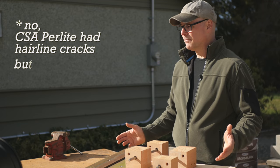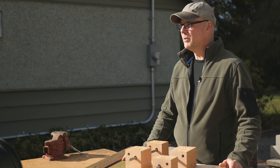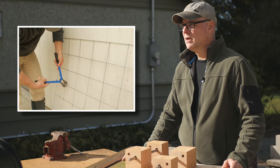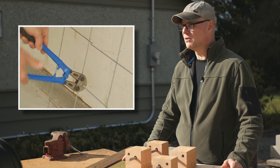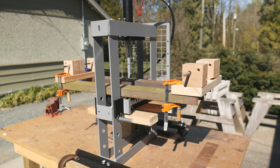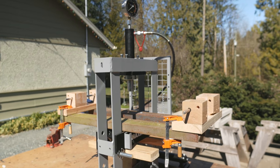Maybe 420 pounds is strong enough for a garden box, but I'd like to push them a bit more. Also, the concrete panel that broke under the truck wheel was from part 2 of the series and had a lighter gauge wire mesh than the hog panel sections used in the rest of these panels. So for the next test, I modified my shop press to hold a panel on steel rods in a similar fashion as the first rig. With the shop press I can measure the weight applied by the ram — there's a gauge connected to the hydraulics that measures force applied in 1-ton increments.